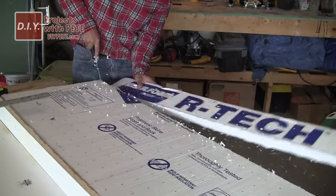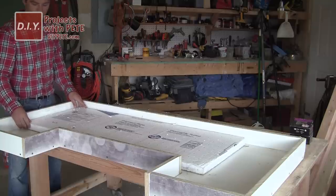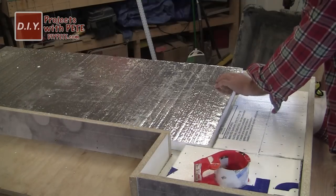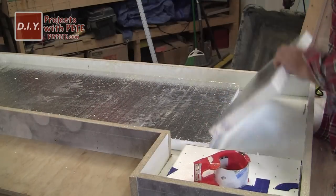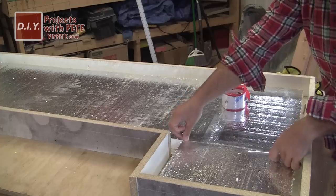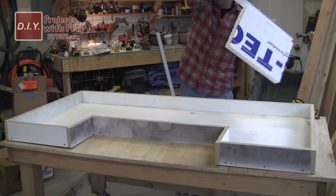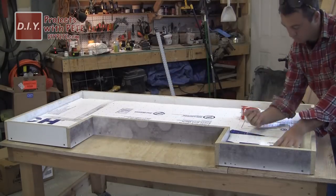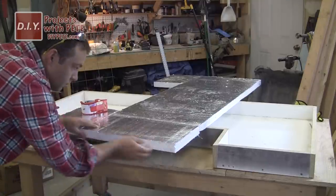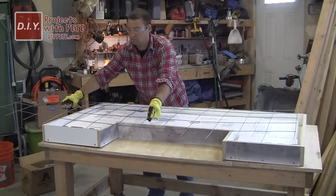To create the apron, I used one and a half inch thick foam on the base of the mold to take up the space where the concrete would otherwise go. I left a one inch channel around the perimeter of the foam for the concrete to flow into. Then I taped all the foam together using packing tape — flip it over and tape the second side to make it one solid piece. Seal all sides of that foam with packing tape as well, which will help it pop away from the concrete during demolding.